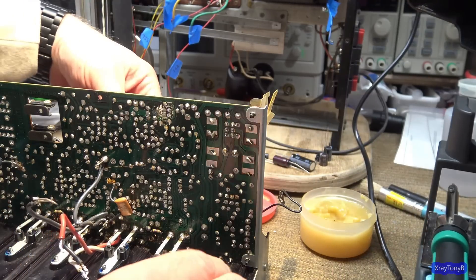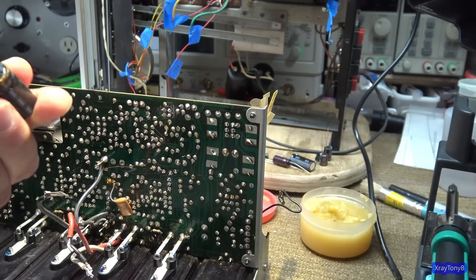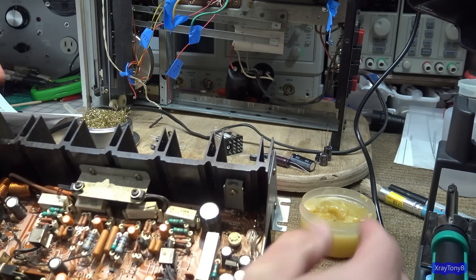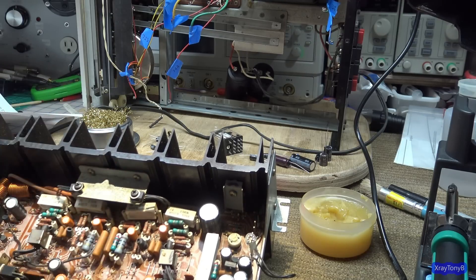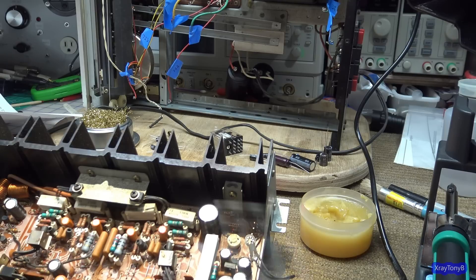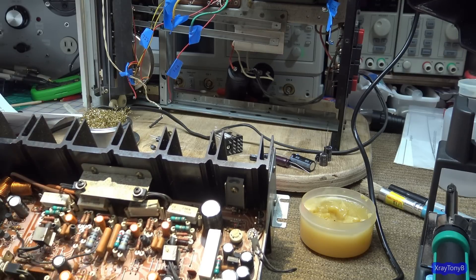I literally just did a quick search online for desoldering pump and that thing popped up and I bought it because it was cheap. So the positive is on this side here and we have to get rid of some of this. It even pulled some of the glue — that stuff is nasty. You can see it's at that consistency right now where you can usually peel it off like that. It hasn't hardened and turned completely corrosive yet, although the stuff on the bottom of the board seems to have done that.